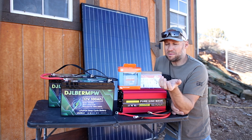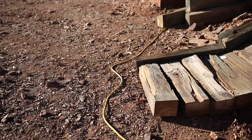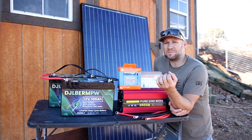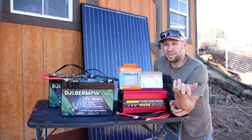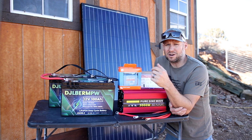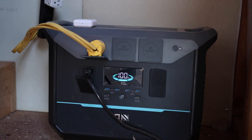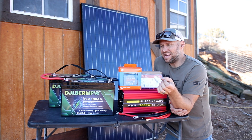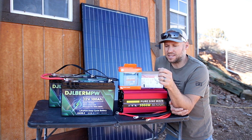The way this project came about is because once I moved my sheds up closer to my house, I was able to run power to them with an extension cord, but it's not ideal. It's a single 20 amp circuit that shares with all of my outdoor receptacles. So if my kids are washing the car or plug in a shop vac at the same time I'm running my CNC router - bam, trips the circuit. I do have a battery backup UPS for my CNC router, but honestly it's just not ideal. I don't want to be stressed about a circuit tripping in the middle of a CNC carve.